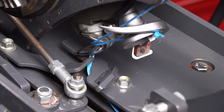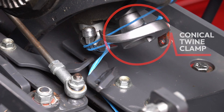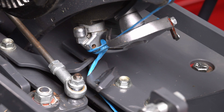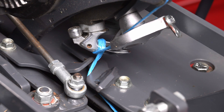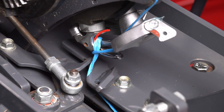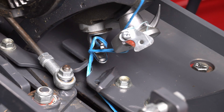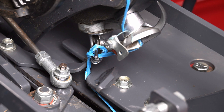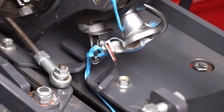When the bill hook has rotated halfway, the conical twine clamp also begins to rotate. As the conical twine clamp rotates, the hook intercepts the twine that is stretched from the needle to the bill hook, while the other twine begins to slip between the twine clamp. As the bill hook continues to rotate, the bill hook tongue opens, intercepting both twines stretched from the twine clamp to the bill hook. The bill hook has now finished its rotation, and the tongue has closed on the twine, applying spring force.